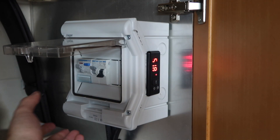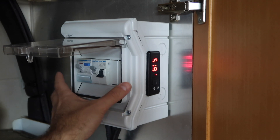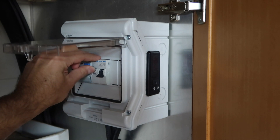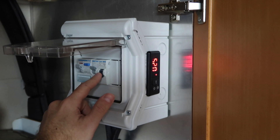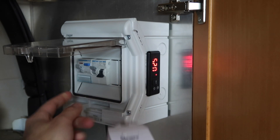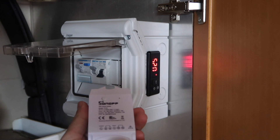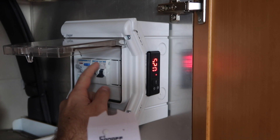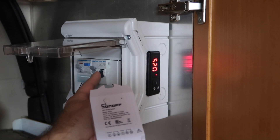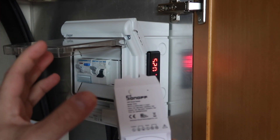Before I install the Sonoff, a quick explanation for those who already saw my solar panel water heating installation. I've got a circuit breaker here — the main one which controls these two. This one controls the thermometer I've got here, and this one controls the water heating element. Today I'm just going to use the Sonoff for temperature monitoring, feeding power from this circuit breaker. In the future, I'll bring power from the heating element circuit breaker to the Sonoff and then directly to the element, so we can decide when to turn it on.